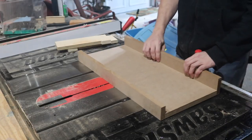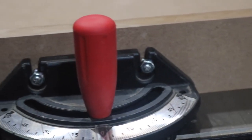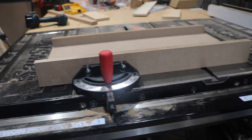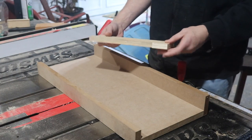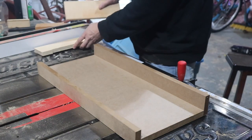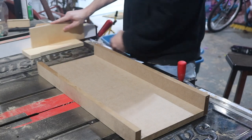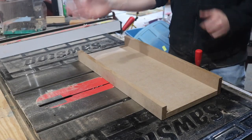Here's the sled. I just did the same thing Matt did in his course. I attached it to my miter gauge here through the holes on the back. I also made a couple of push sticks. It's just a piece of plywood with another piece of plywood glued down here, and that's for ripping thin strips of wood. So I can push through the blade and keep my hand up away from it. I'll get to that in a minute with the poplar.